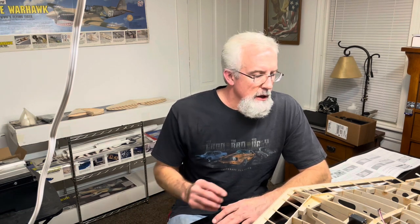All I have left to do is drill the 5/16 hole in the leading edge center for the wing dowel. I'm going to go ahead and join together all my wing sheeting so that whenever I do get the retracts, I'll be able to jump right into sheeting without having to join them later. I'll sort them out, the nicest for the top side of the wing and the not so nice for the bottom, but they all look pretty good to me, so we'll see. So without further ado, let's get started.